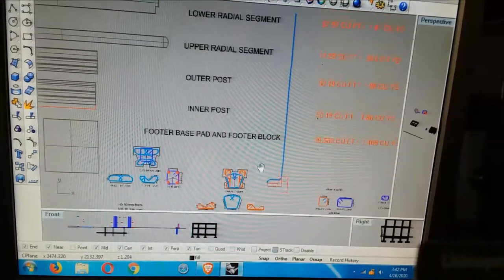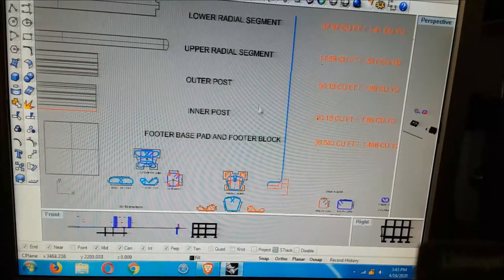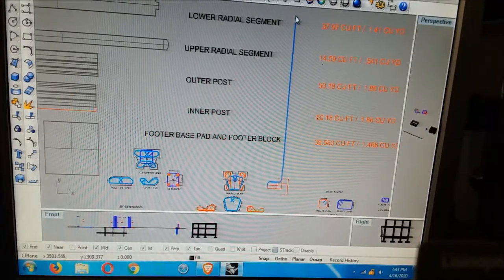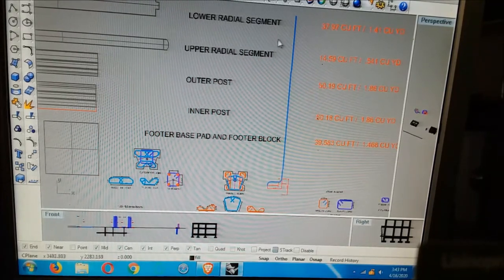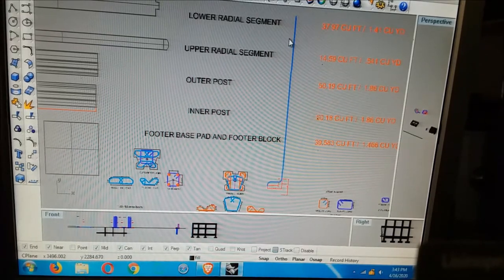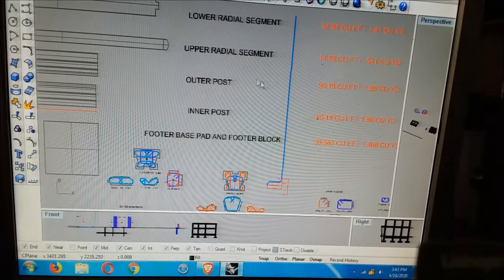That's what it looks like in the house. It's sticking upright. And if you look at any of the pictures of the house, like in the slide shows, the bars you see sticking out of that lower roof slab, those are these bars. There's 21 of them, but all but six or maybe eight of them are bent into the slab to tie the slabs to the columns.